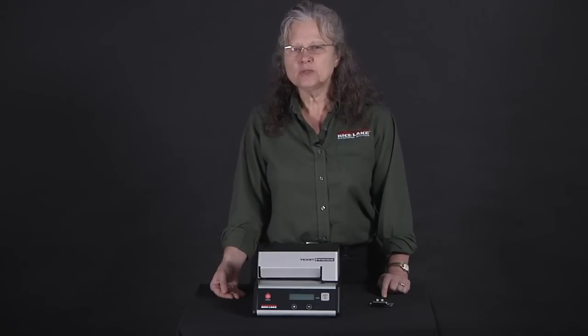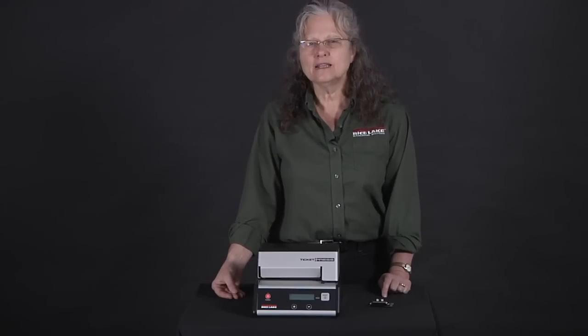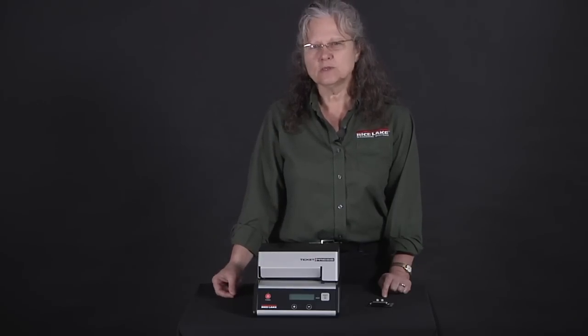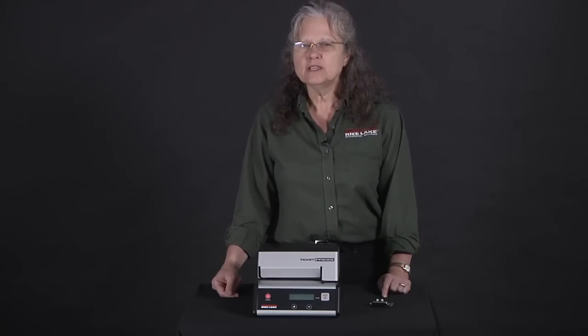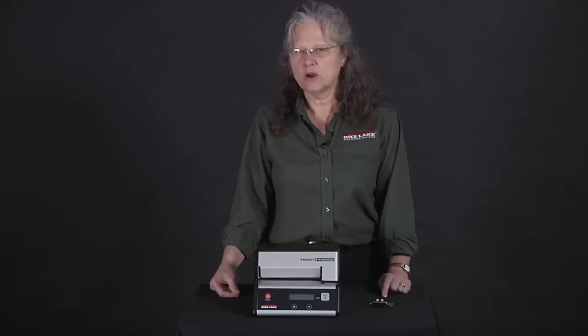High impact mode is one of the features of the printer itself. When this is on, the data is printed in a bold format. It actually does 3 strikes, so it's like a 3-strike impact. And this reduces the speed of the printed ticket. With this, you can print on 4 carbonless copies or 5 carbon copies.